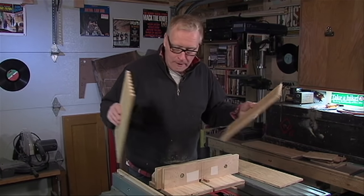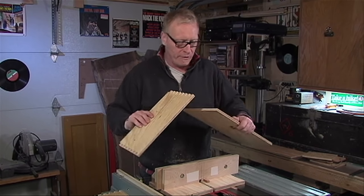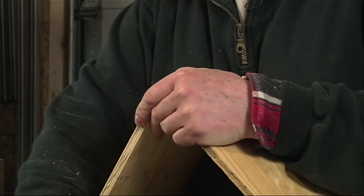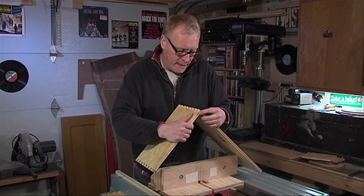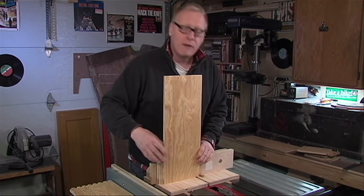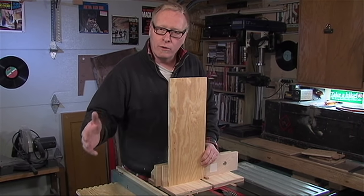We have our sides cut. Now you just want to line them up — don't forget we cut these the same, it's easy to get turned around. We're going to figure out our outside and that'll dictate whether you start cutting a socket or a pin. We need a pin at the very end of this one. Do the same on both sides for both boards — the top and bottom — and then we have all the joints cut. We'll go ahead and glue up our box.